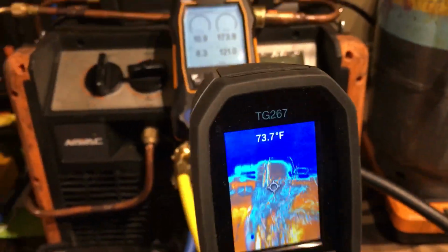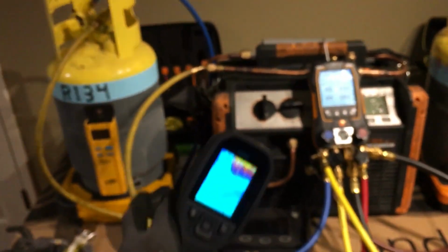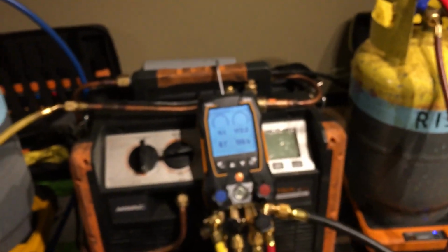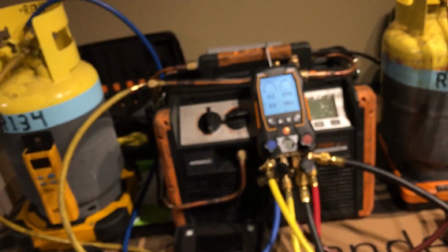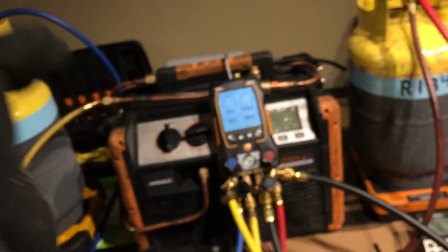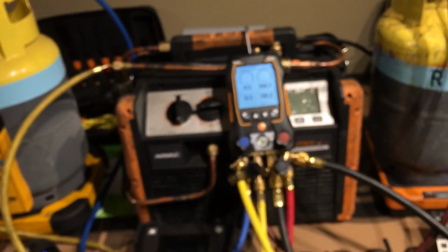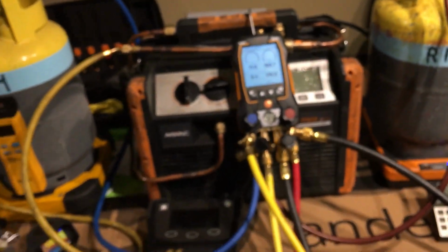All right. Pressure temperature relationship. You cannot tell how full a car is by the pressure inside of it. We have roughly 20 pounds of refrigerant here. We have 20 pounds of refrigerant here. But yet, look at the pressure differences. If a car is sitting inside my shop and it stays there overnight, and I go hook up my gauges on it in the morning, and I'm in North Dakota and it's 20 degrees outside, I'm going to be closer to this. If I'm in Arizona in a heat wave and it's 115 degrees, the car with the engine running, the windows up, it was sitting there hot soaking for the last 15 minutes when you just turned it off with the hood closed, and I go to hook up my gauges, I'm going to see something close to that.